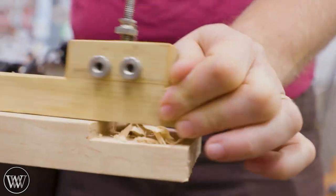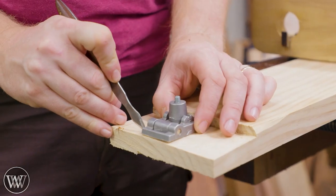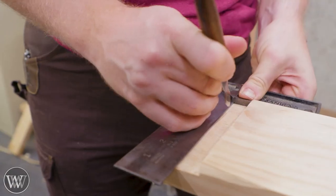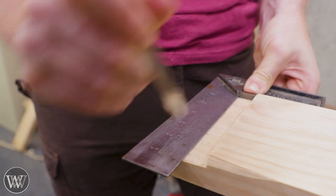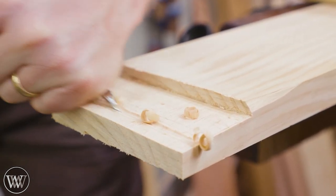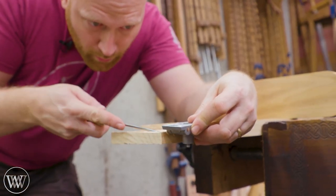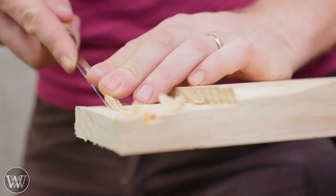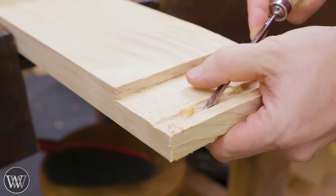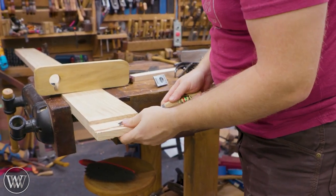This doesn't have to be terribly precise because it rests on several of the rounded grooves going into it. Cut off any extra scragglers and now we can lay out where these rounded grooves need to go for the hinge and the other rounded sections. I'm basically going to create a groove rounded that it fits into. If you've ever done a blood groove on a cutting board, I've got a whole video on that. Mark out the two sides, find a gouge close to the radius you want, and with a little stabbing motion you can get a really nice clean round edge. As with anything with hand tools, take your time, take it slowly, test often, make corrections, and then do it slowly again. Work with one groove until it gets close to the right size, then start on the other.